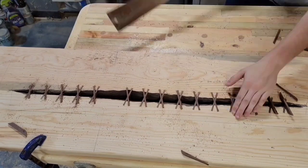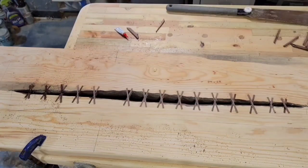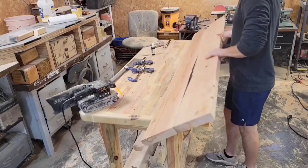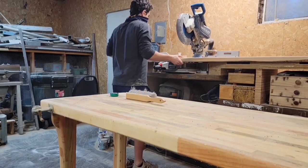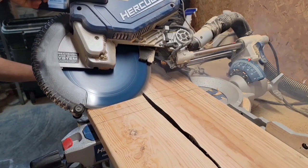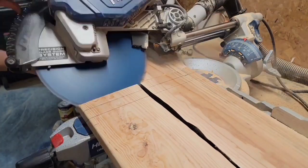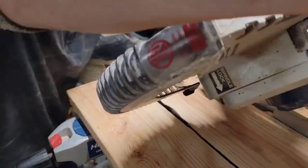You'll probably notice an awkward space where I should have had another stitch. I left that gap there so I can make a miter turn to make the legs of this bench — I thought it would look weird if the legs turned right halfway through one of the stitches. This is also the part of the video where I tried to burn my way through half a miter with a dull blade and filled my shop with smoke. I changed out the blade and finished all the miters, and since my miter saw doesn't reach all the way, I finished each cut with a pull saw.